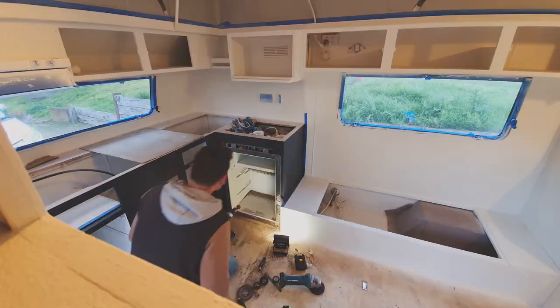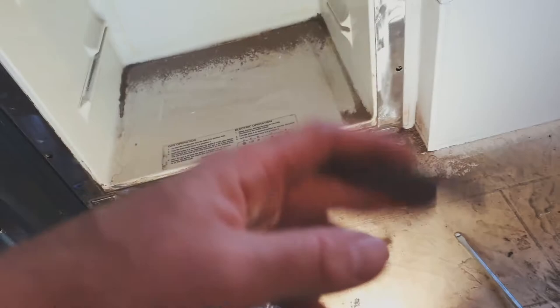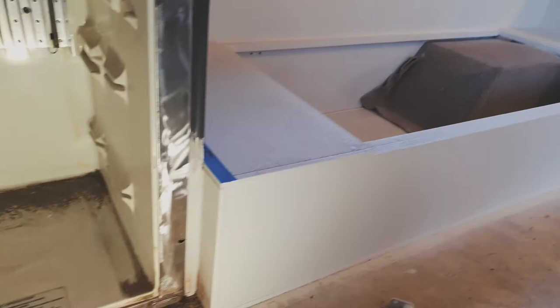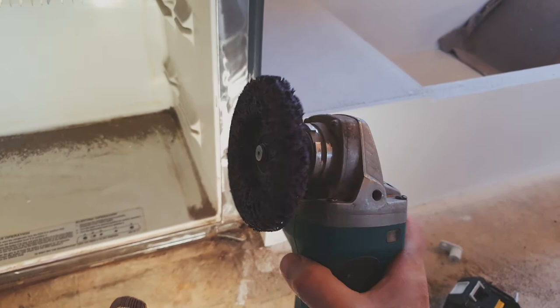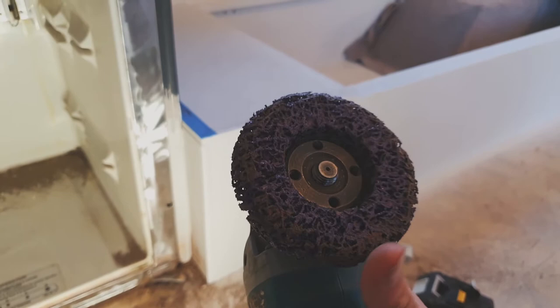I was only going to do a little bit of it, but it had little bubbles all through it, so I went around the whole lot. Flappy discs are great for metal, but they take off actual metal with it and leave score marks if you're not careful. I found these other pads really good — you get them cheap on eBay in a bulk 10-pack. The bits of it just slowly come off, it lasts a while, it doesn't spark much, takes off all the paint, and leaves a really smooth surface. Flappy disc leaves scoring, but the smoother stuff down here — you can feel it's super smooth, doesn't wreck your metal, and you can paint pretty much straight over it.